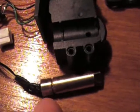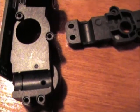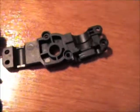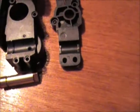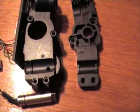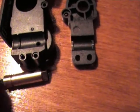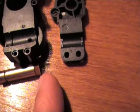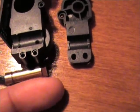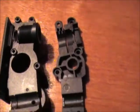The laser sits right inside there. You can see that groove in the back of the plastic corresponds to the groove right here where it sits in. There's a hole where it looks like they potentially thought about putting a set screw to hold everything down. The compression from these screws appears to be enough — it's not under any real force. It looks like they use these flat ends as a means of rotating, so they'll rotate this to get the beam at a point they like, since it might not come out exactly parallel with the body of the module, until everything lines up with the imager.